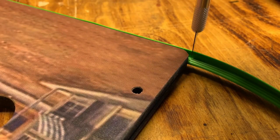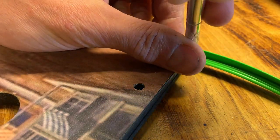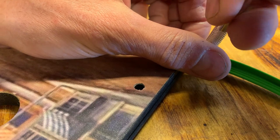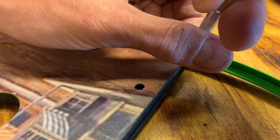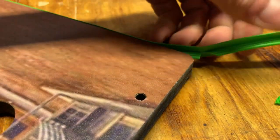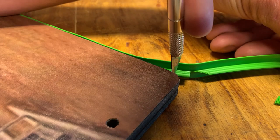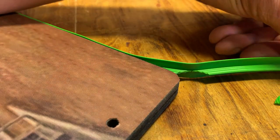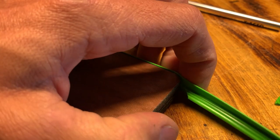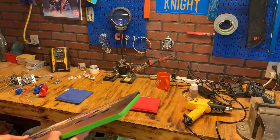When you come to these corners, this is the way I do it: I do a center cut straight up and then V outward — that just lets you make the bend by taking out some of that material in the T-molding, creating a big notch. That's half the notch; you pull your T-molding out and continue, mimicking the same thing on the other side. You'll end up with a big V-shape — or pizza-shaped, which is appropriate for Ninja Turtles — a wedge-shaped piece you cut out, so as you bend it around the ends won't make contact inside the wood, giving you really good results. Use a rubber mallet to tap these in, not a regular hammer.